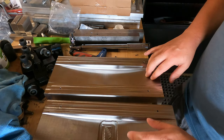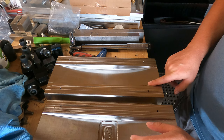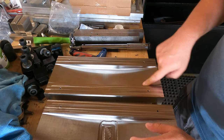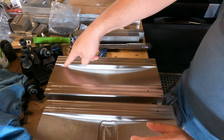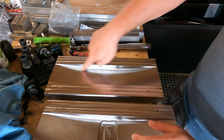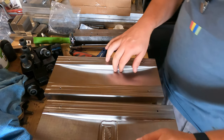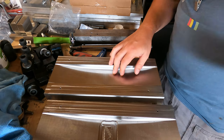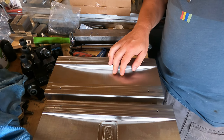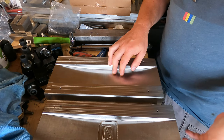I finished up this part. I used a half-inch ball mill to clean up the floor, but followed it up with a quarter inch to get the radius, because I've got a callout on the radius here. So we used a quarter inch to clean that up. Now let's reposition the camera and look at the one that failed.